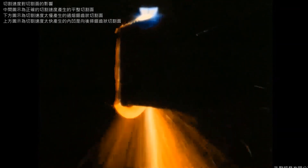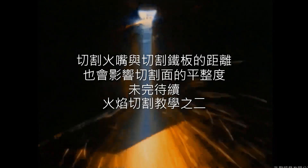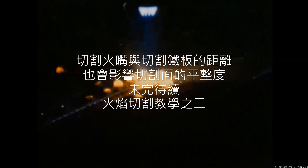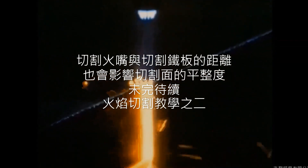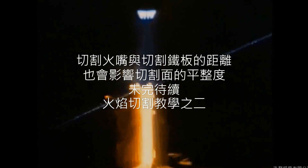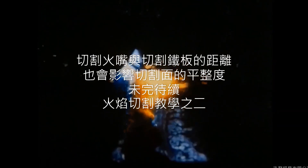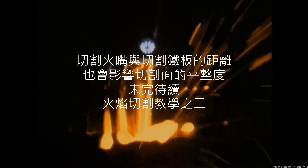A further influencing factor is the nozzle distance, once more with special reference to the quality of the cut. In a pass over a 25mm plate, the nozzle distance is varied from immersion of the heating flame to a nozzle clearance of 30mm. For the nozzle used in this operation, the cutting table specifies 5-7mm distance from the plate. Although at a larger nozzle distance the number of molten beads at the upper edge increases, with a vertical cutting position the quality of the cut is nevertheless satisfactory. The results obtained at the same nozzle distances in bevel cuts are quite different. Here, a 45 degree cut — where the nozzle distance is too small, the cutting stream tends to be unstable and cratering occurs. Only on reaching a mean distance of about 8-15mm from the plate are defects eliminated.